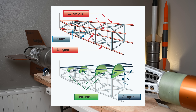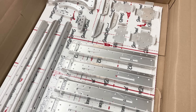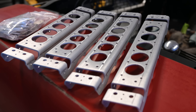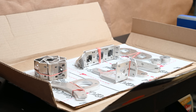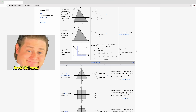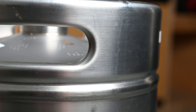The spars are the backbone of the rocket, and there are also perpendicular elements which I call ribs — and chances are anything else is a bracket of sorts. Almost all these parts are cut and bent from 5052 H32 aluminum sheet. It's not as strong as the ubiquitous 6061-T6 alloy, but it's cheap and especially easy to bend without cracking. Forming or bending has been employed extensively here — if designed correctly, forming can radically improve a thin section part's ability to resist loads, which is why it's key to Keg Rocket's construction. Because they're made from sheets, they're inherently thin and light, while the bends make them stiff and strong.